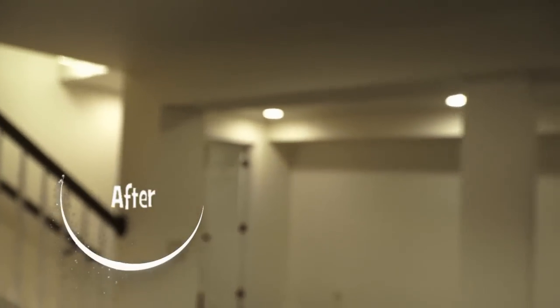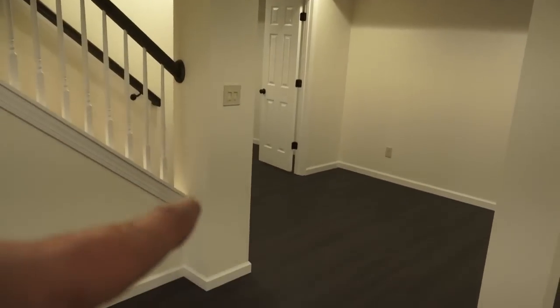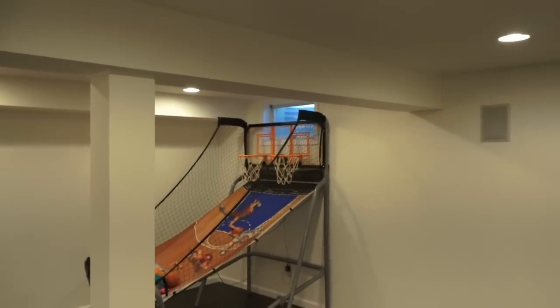Our final obstacle was that wood beam that went from the base of the stairs all the way across to the exterior wall. It was actually resting inside the window wall on one end and was held up by two columns we boxed out and a third column right at the base of the stairs. We built a soffit around that — and there's what your finished product looks like: a nice clean drywall beam. That's how we went around the obstacles on this project — with smart framing. Framing hides the obstacles before the drywall goes up. I'm hoping this video answered some questions for your project. If you like this video please hit the like button and if you haven't subscribed to my YouTube channel please do — I've got a lot more useful videos coming your way.